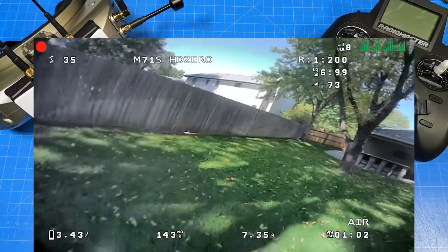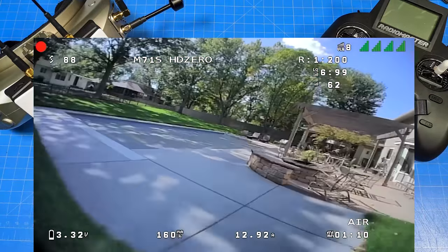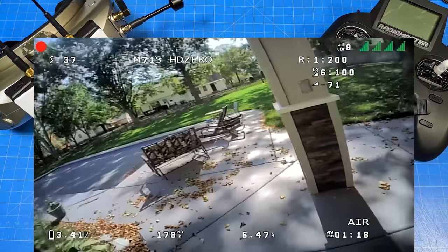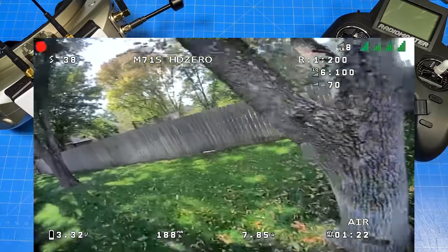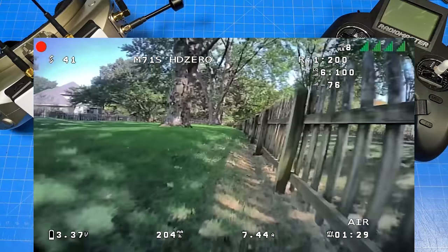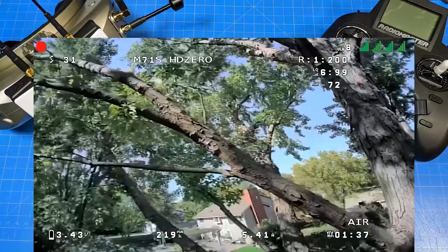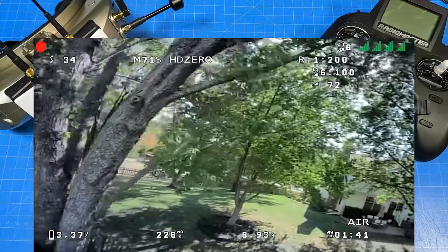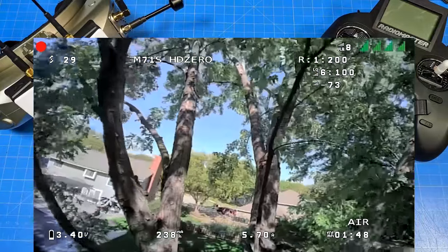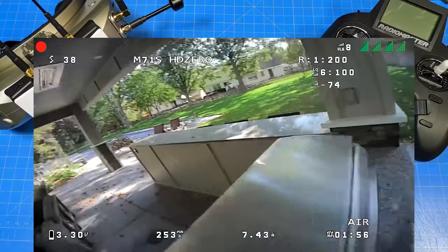If you're looking for three-minute flight time and you fly like I do, you're going to need good, relatively new, fresh batteries — and you might still want to switch to a different connector. Going to a GNB-27 or a BT-20, I think you'll find battery sag is less, performance is better, and flight time will be equal or possibly better. You don't necessarily have to solder directly to the board; you can splice a new pigtail into the existing wires. Some people are averse to soldering on these thin boards because too much heat can cause components to shift and leave you with a board that doesn't work.